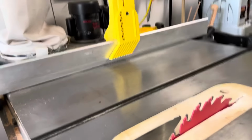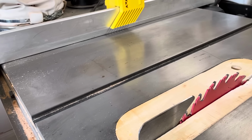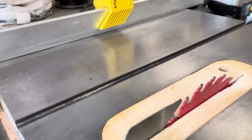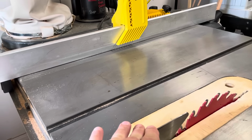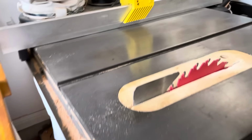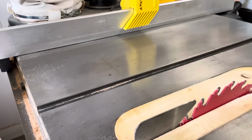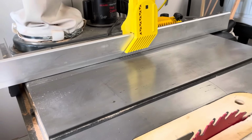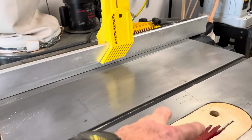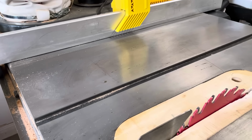Now, of course, you take the table saw. I find this the most dangerous saw in the shop, and the reason is because the blade is typically exposed. You see a lot of people saying leave your guards and things on there, and I typically did. I later converted this to have a riving knife, which I find makes the saw a lot safer. This is an old DeWalt saw. In Europe, it was sold with a riving knife, and if you knew someone in Europe, you used to be able to get parts and you could convert it, which is what I did. But you see people constantly reaching their hands over the blade and very near the blade, which I find incredibly dangerous.